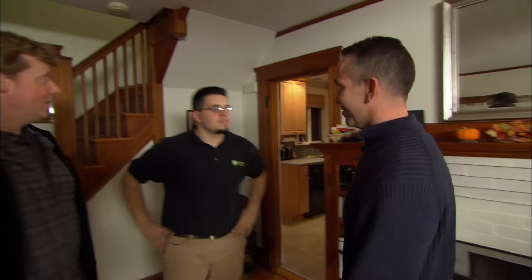Hey guys, you're almost done? Yeah, we're all done. I found a long list of opportunities for you to increase the overall energy efficiency of your home, but I'm going to write up a comprehensive report so we can talk about what you should prioritize. I'll tell you right now, your biggest point of heat loss is coming from your attic — you should insulate and air seal that. I really appreciate the help you guys gave me today, and I'm looking forward to reducing my energy bills in the winter.